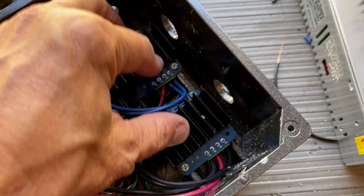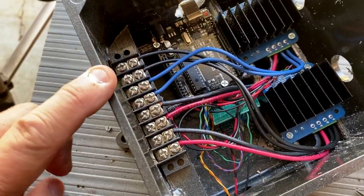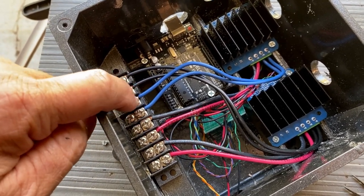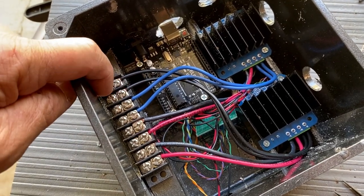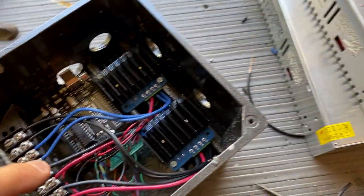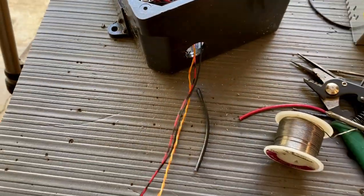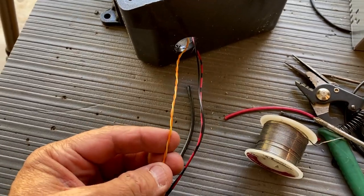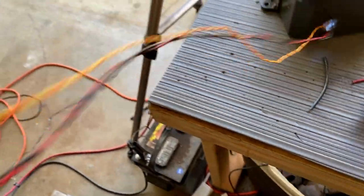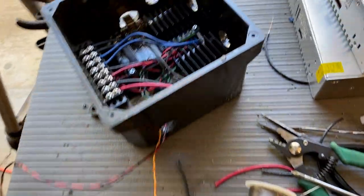Both IBTs are mounted. I did cut the board for the Arduino — it's just sitting there, but this will allow you to easily swap motor wires if they're going the wrong direction when you first set it up. This will be engine number two and this will be number one. The orange and yellow wires are going to the potentiometers — both potentiometers — and this relatively long section is going out to them.